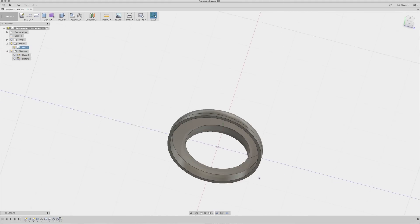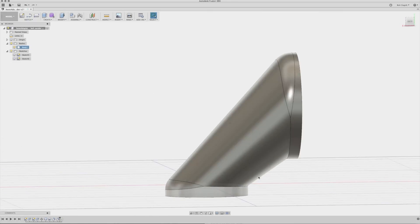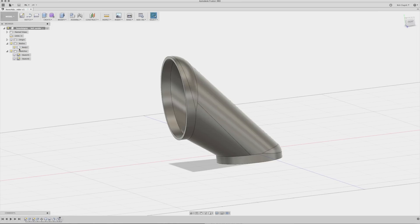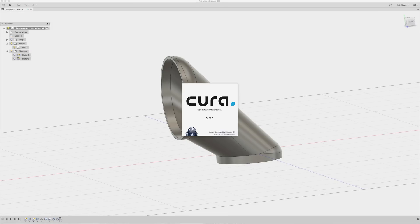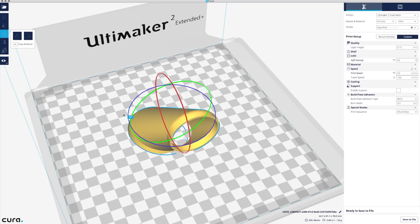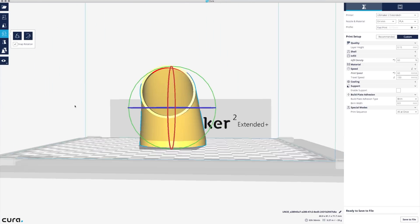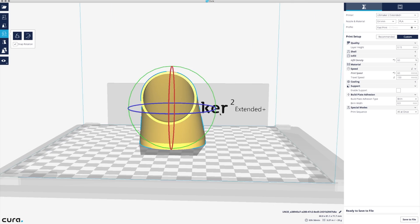And that's really all there is — there's not a whole lot to this model at all. I selected this shape from the list on the left and right-clicked on it, and one of the options is Save to STL. I've got mine set up so that the STL file goes directly to my slicing software, which is called Cura. From there, I can set up all of the 3D printing settings — in this case, I did really low resolution, the quickest build I could make.